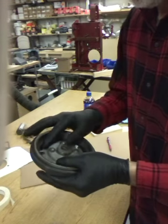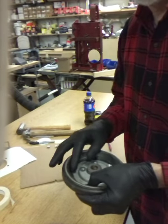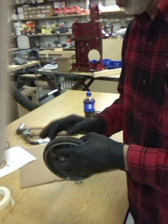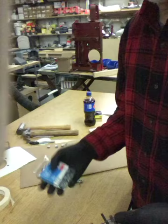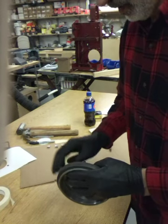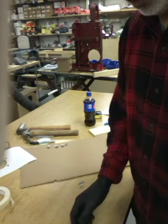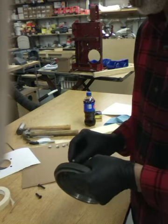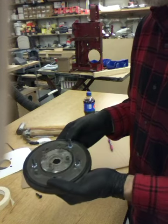I got all five of them chamfered — they're completely flush. You don't want to go too deep because that gives something a place to catch on — it'll be the hole you've made. To put this together I'm going to use a standard quarter-twenty nut for now. When I put it together for actual use I'll put nylock quarter-twenty self-locking nuts on them — you can buy them at any big-box store. The bolts I had laying around were way too long. A half-inch bolt is all you're going to need. If you can't find short half-inch bolts, buy what you can and cut them off.